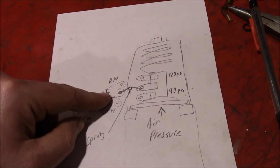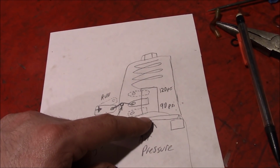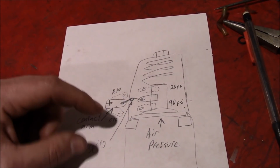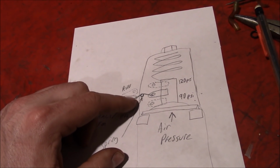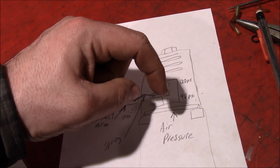Now, the pivot point of that contact is right in the center of the stroke for that plunger. And connecting the two, there's a spring. It's got two little tangs on the end. It goes up, coils around in the middle, and back down with another tang. Now, that spring there, it takes up the distance between the two as it gets further and closer together.